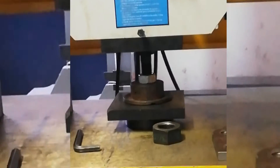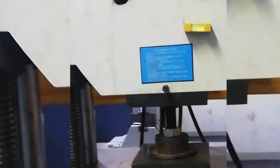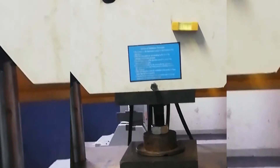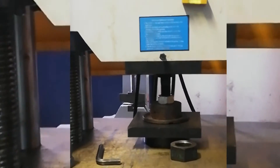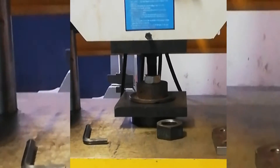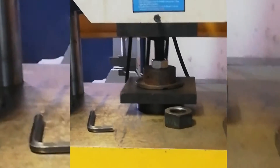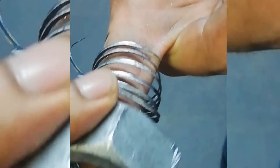After the load is removed, you need to try to turn the bolts with your fingers — it says so in the testing procedure. If it does not turn freely, it is deemed to be a failure, and you can't carry on with manufacturing. They are testing this so they can manufacture more bolts at that grade with the correct specifications. That is basically the proof load test. The question is why it's not breaking — this one is passing, same as the previous example.